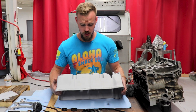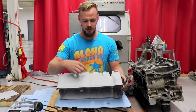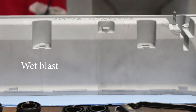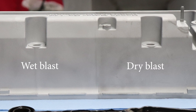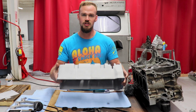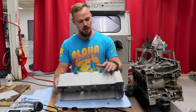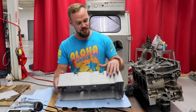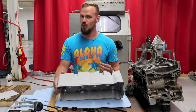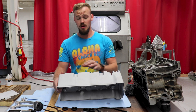This was the tape line — I tried to get as close to half and half as possible. This being the wet blasted side, this being the dry blasted side. You can really see the consistency differences between the two types of abrasive blasting. Dry blast is kind of splotchy.